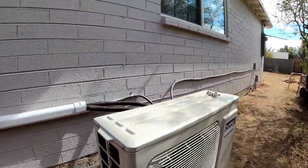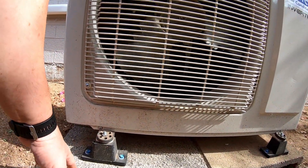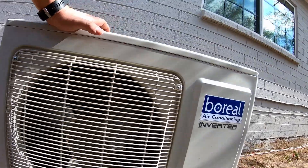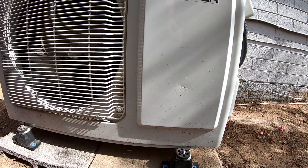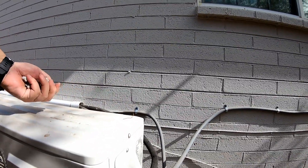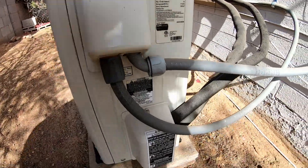The unit has been here about a year now. You can mount it various ways — we don't get snow here so I wasn't worried about that, but it does get rain. What I did is poured some cement on the ground, used cement blocks set in that cement bed to raise the unit up off the ground, and then used rubber isolators. Those rubber isolators make it really quiet — if I stop talking you really can't hear it; you have to get very close.